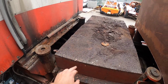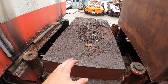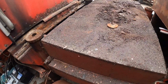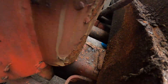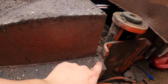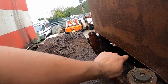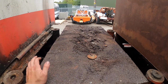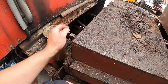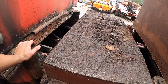These are the ballast blocks that were put on here to sort of absorb the whip of the frame when the hammer was pounding. They're going to come off. That weld down there, another one on the other side, and one either side here and on that sleeper mount are all that hold these on. Luckily, these two, so that one and the other side, have already cracked. I'm guessing they were just a bad weld.